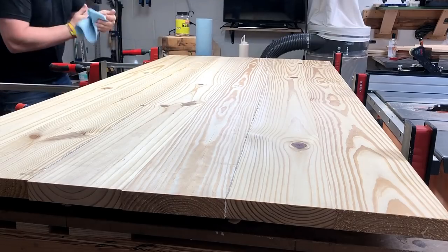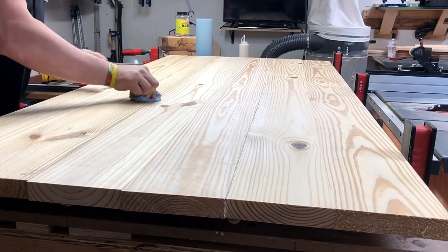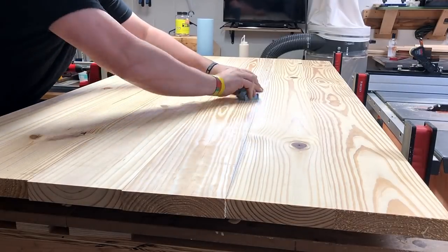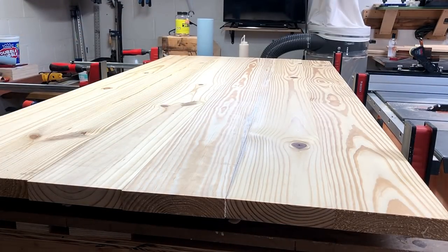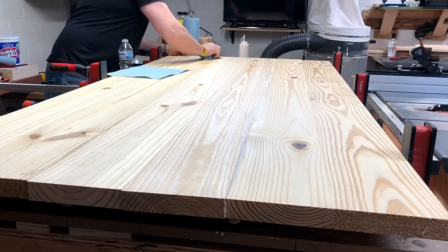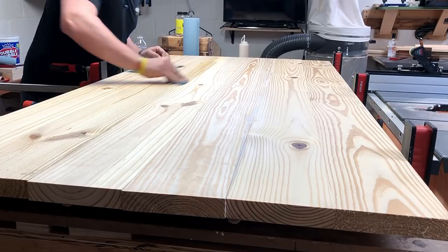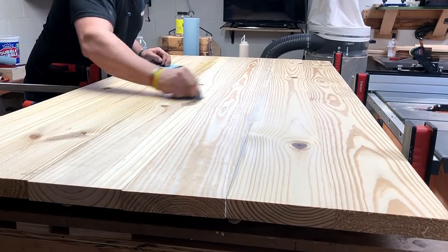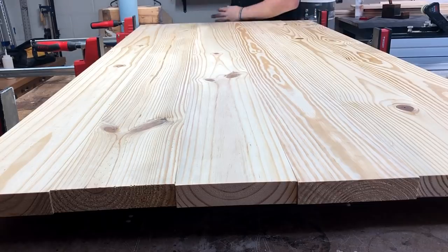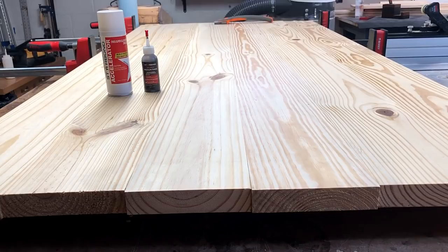While this is being glued up, I first just go ahead and wipe all the glue squeeze-out with just a dry towel, and then I go back with a wet towel and get it even more. After I get the main glue squeeze-out off, I go back with a wet towel and try to get the rest of it off, and then finally I use a paint scraper to scrape out the rest after I let it dry for maybe 20 minutes or so. Just because if you start scraping it while it's wet, it kind of pulls up the fibers a lot more and digs into the wood more. You still have to go easy with a paint scraper, cause you don't want to tear into the wood.